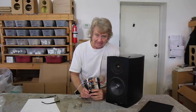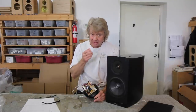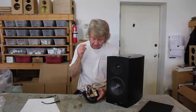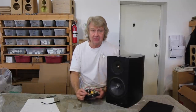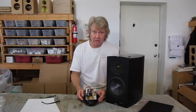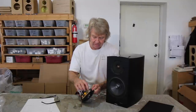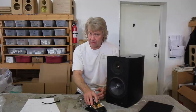The crossover though — eek. This one isn't even built on a circuit board, it's not even point-to-point wired. The connections are just dropped into little solder spots to make the connection. There's an iron core inductor on the woofer circuit, electrolytic caps, a sandcast resistor. There's one poly cap probably on the tweeter circuit with a tiny little inductor — dental floss gauge. They put the money where they wanted it on the cabinet so it looks good to the eye, but to the ear there's some stuff holding this one back quite a bit. Ferromagnetic screws and pretty cheesy binding posts.